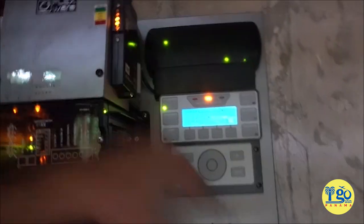When it hits optimum charging, the top green light will start flashing. Over here you have your percentage level — it will tell you what direction it's going. Right now the arrow is down, meaning it's draining the batteries and pulling the charge. When we start the generator, the arrow will flip and tell you which way you're going and how much you've charged.